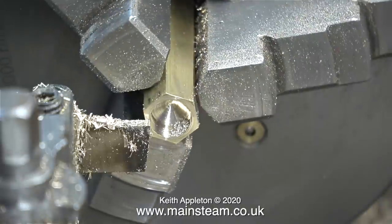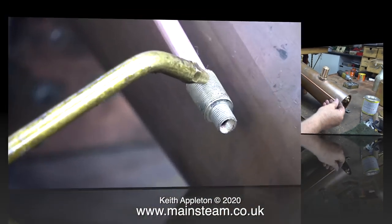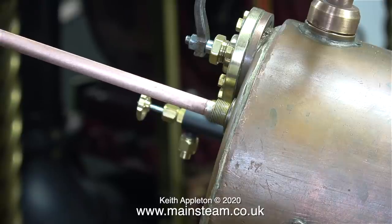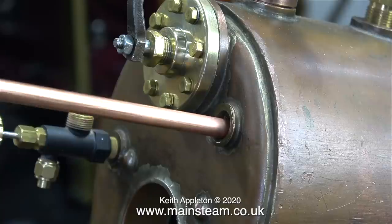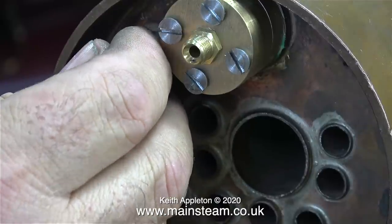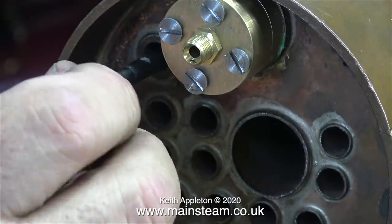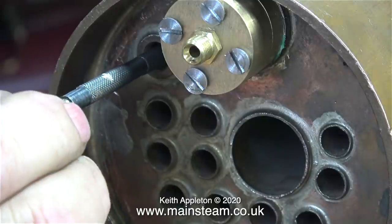After silver soldering the second part onto the hollow stay, now it's fun time. I recommend you have written down on a piece of paper the Samaritans' phone number, and possibly even the address of a local asylum — and just continue watching to understand why. This first bit is easy: a small amount of lubricating oil eases the first fitting through the bush on the back head. But this is where things go wrong. I now need to continue screwing the hollow stay into the other bush on the smoke box tube plate end. Using my scriber in the hole and occasionally touching the hollow stay is not the way to do it.